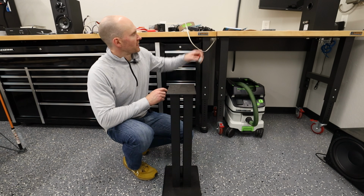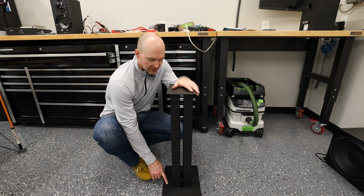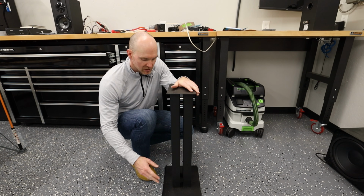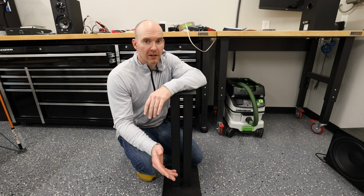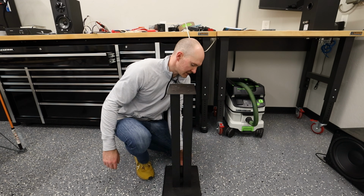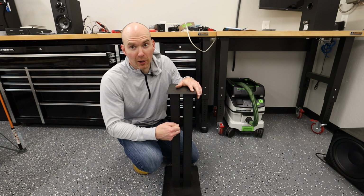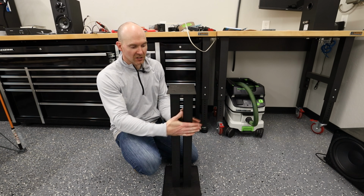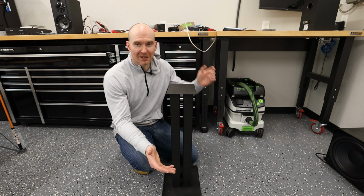And beyond that, I guess the only thing I can really think about is on the underside of the bottom, which is still kind of a thin steel that I don't think is really going to matter between the feet and all the sand on here, but you could take some sort of reinforcement material, kind of like a Dynamat that they use on the interiors of cars to reduce the resonance that occurs. You could line the inside of this underneath it so you'd never know it was there, but it would add a little bit of deadening to that bottom plate as well, where these are really dead here, but in the bottom, we still have that. But it shouldn't really come into play because this should essentially kill everything from here to here. So I don't think it's necessary, but it's another step that you can take.